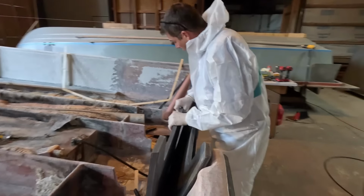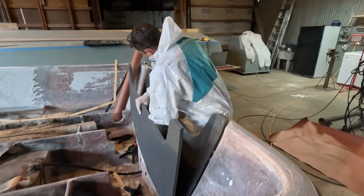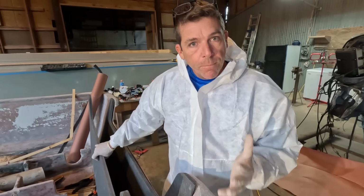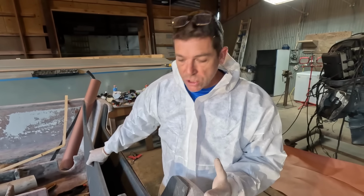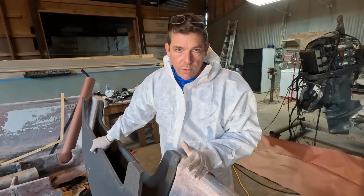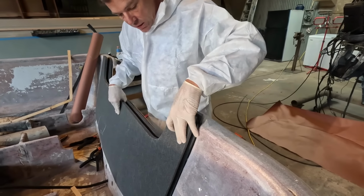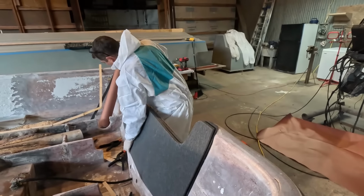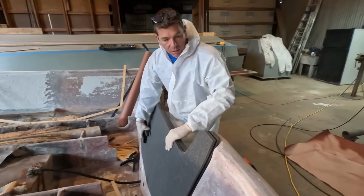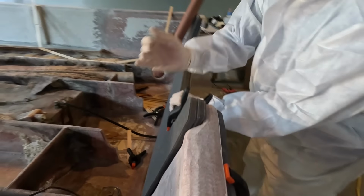Now, as I said earlier, this was originally 2 pieces of 1/2-inch plywood, and I couldn't get any 26-pound Coosa in 1/2 inch, so we're going double heavy, which if you go back and look at the videos when we built our big 29-foot offshore boat with the twin 150s, we used 2 layers of 3/4 Coosa, just like this. So I am absolutely positive that this is going to be plenty strong. Can't emphasize that enough.